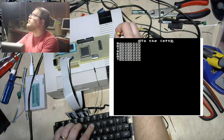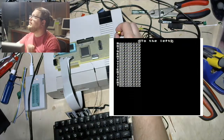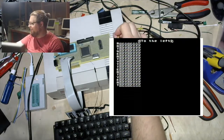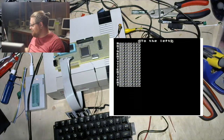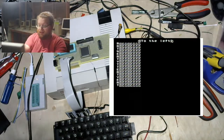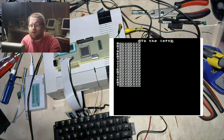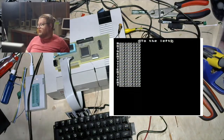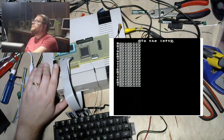Welp, that is fairly damning. If it didn't work, that means it doesn't work. Which is good in a way, because that leaves me without any hesitation in knowing decode is not working properly. So, pretty clear, probably the MMC3 mapping stuff that I'm doing to try and make sure that C1000 maps to A17 low, A18 high is wrongo. So we will have to visit that tomorrow. We will look at making sure I have the MMC3 set up correctly, but there you go.